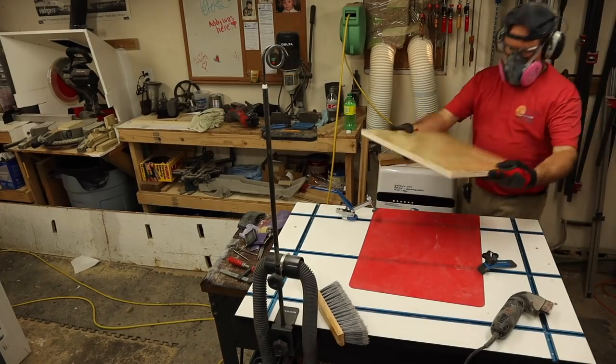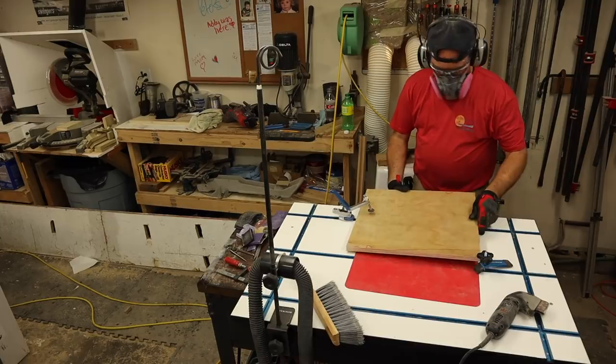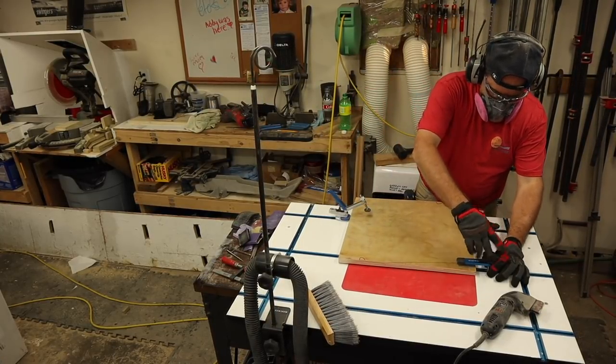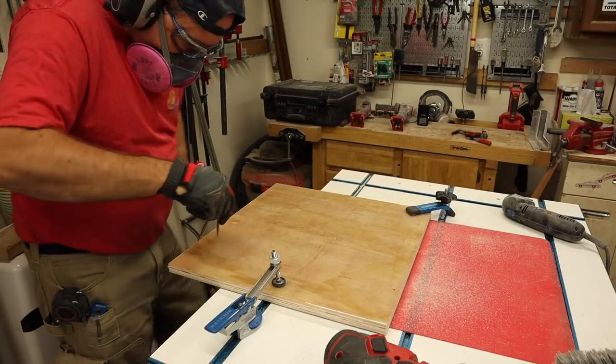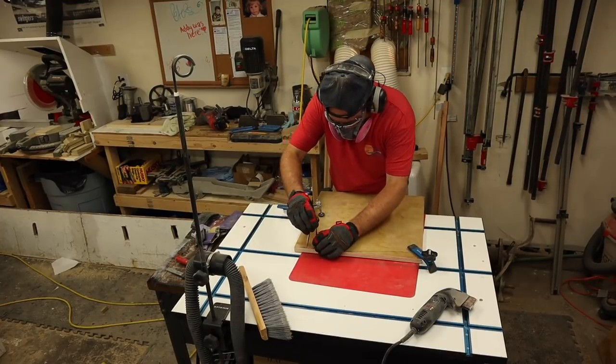Just like our diesel tanks, our water tanks will require baffles to combat the free surface effect. Of course, they can't just be solid panels. They need to have passages that allow both water and air to pass through. So we'll notch out half circles on both the bottom and the top that will allow the water to move freely to get to its discharge point.